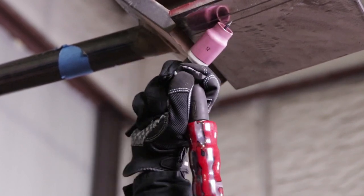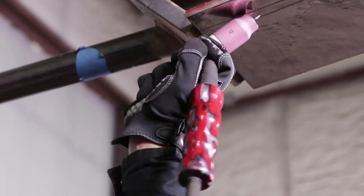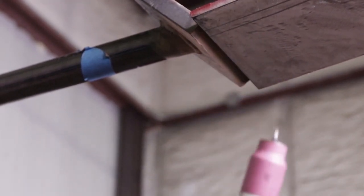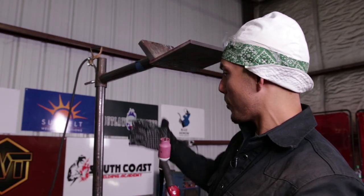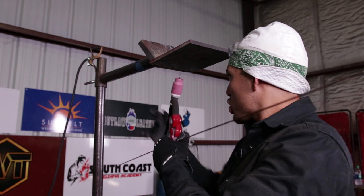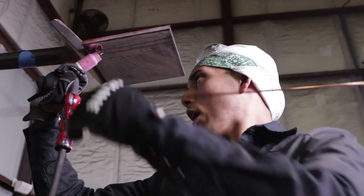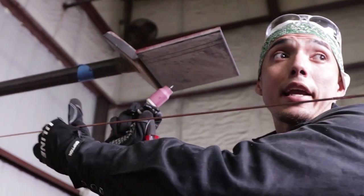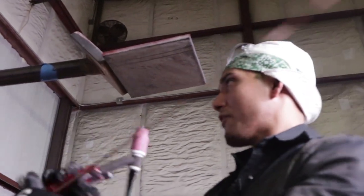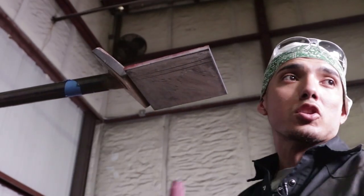These are three different ways, which I recommend knowing how to do all three, because of brother-in-law welding. If y'all don't know what brother-in-law is, if you're new to this, it's when somebody's beside you welding the same plate or same pipe or whatever the case may be, okay? If he's in front of me and we want to start together on the pipe or plate, I would recommend welding like this. Why? So he can start right here and I won't be in his way, okay? If I'm like this, he's gonna have to wait until I get to about here in order for him to start, right?